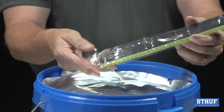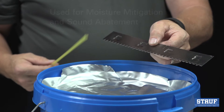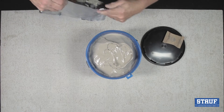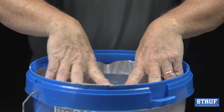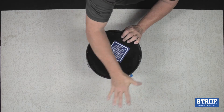The foil and the silica bag will help keep the remaining adhesive fresh and usable. In addition to the silica bag, you'll see our number 12 clip-on blade for use with any trowel you may have. This trowel is important for the moisture mitigation and sound abatement qualities of the adhesive. When resealing the pail, simply place the foil back down on the unused portion, separate as much air as possible between the foil and the adhesive, then replace the silica bag and snap the lid back on.